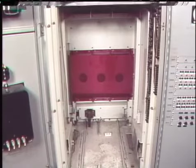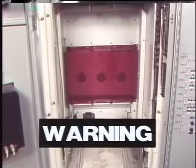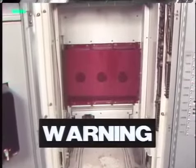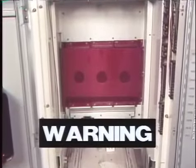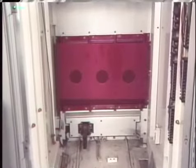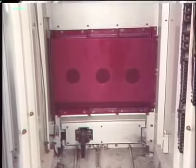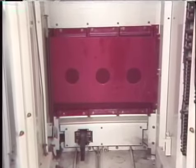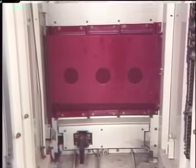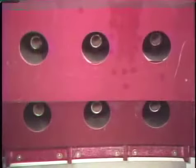Common tasks include inspecting and cleaning the interior of the cabinet. A general warning: before starting work inside the cabinet, make sure that the control power circuit is de-energized. In addition, even though the breaker has been removed and the control circuit has been de-energized, the bus and line connections inside the cabinet may still be energized.